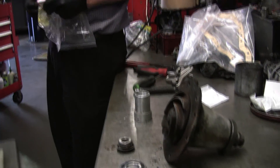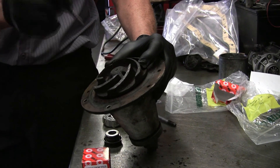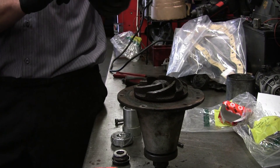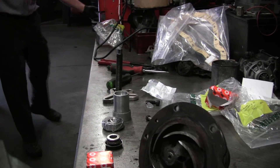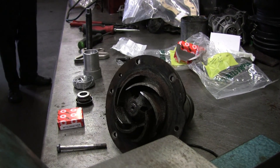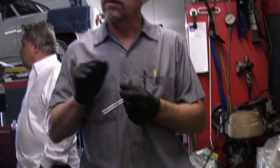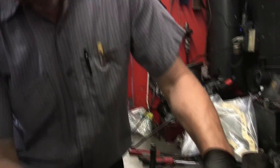These are just FAG double-sealed roller bearings — pretty standard. The bearing numbers are 6205 and 6204, which you can get from McMaster-Carr. To pull this impeller, since the threaded holes were full of rust, I'm running a tap through them — they're 5/16-24 threads — so that my bolts will go in cleanly. Be careful not to bottom out and ruin your tap. What typically triggers a rebuild is either the bearing or a water leak — usually the seal goes bad and washes all the grease out of the bearing.